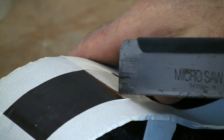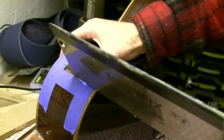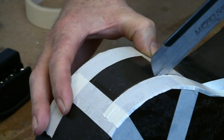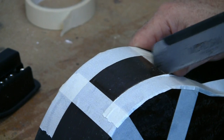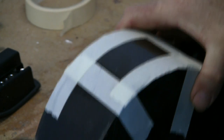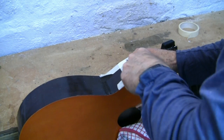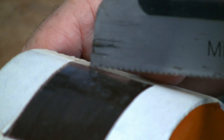It's a funny thing — the improvised rusty tenon saw I used on the first demonstration actually has the weight, which is an advantage when sawing. This little guitar maker's saw, which is used for cutting frets mainly, has greater control all in all but lacks the weight. As I'm using just the end few teeth, all the force in the sawing action has to be directed to the tip of the saw through your hands. But actually it's easier with this little saw.